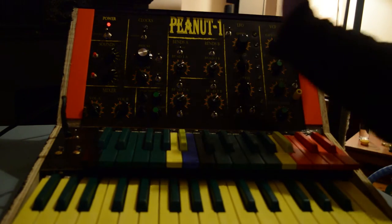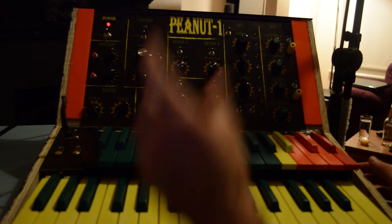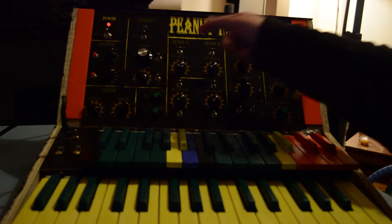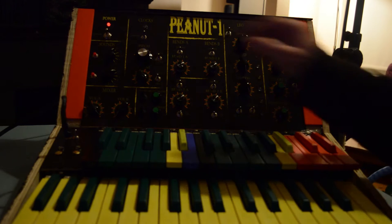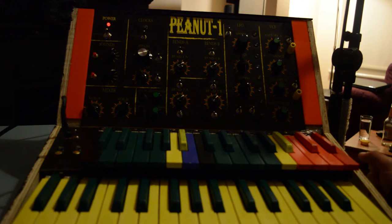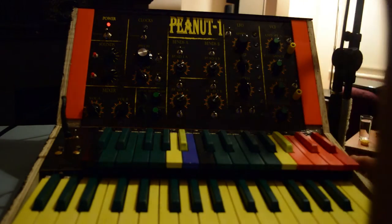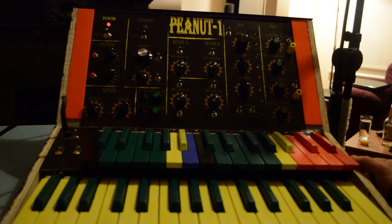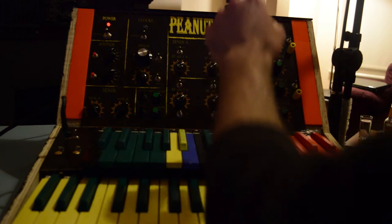Right, and same goes for the second keyboard, so it's all replicated, it's all double. Here, the tags are again wrong because I didn't have the time to update them. And this is another feedback, and it's done by short-circuiting some of the IC386 that is inside, and it works as the amplifier. So this one creates a nice feedback, some kind of oscillations that can be modulated through the pot, but also through a light dependent resistance.